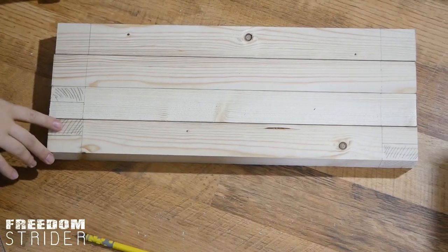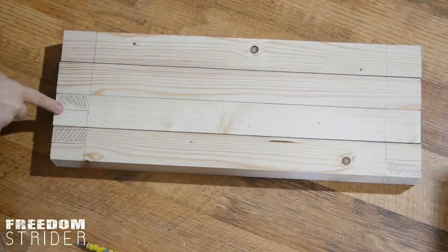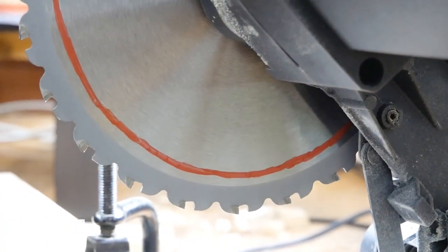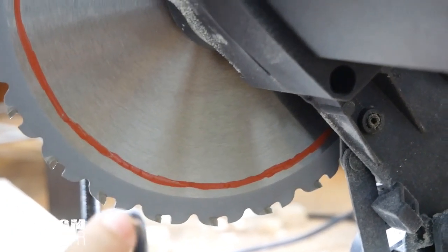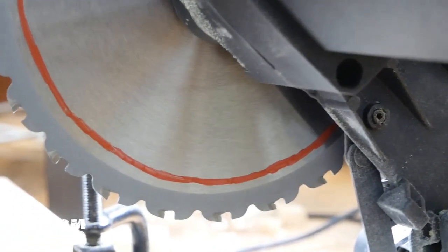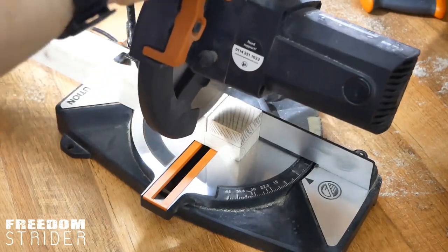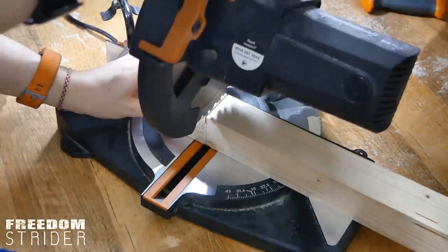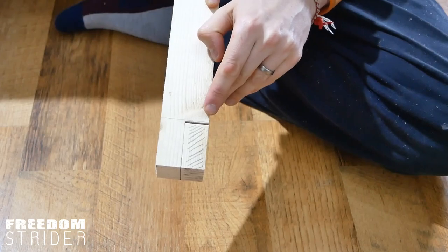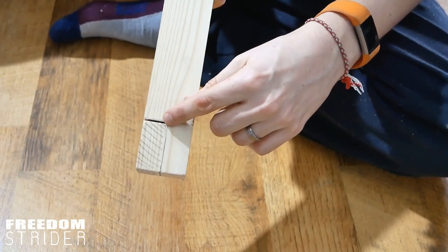This is the one I made earlier. As you can see, one side is hashed on this one and the opposing side is hashed on the other, so they need to crisscross — and you do that on all of them. Because our saw does not have a stop, we have to manually stop the saw before it cuts lower than it should. So we marked two centimeters up the saw so as we spin we see that red line and don't go too far. We've cut down on that side, flipped around and cut on the other side down to the line. Now all we need to do is cut along this line and this chunk will come out.